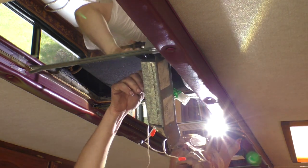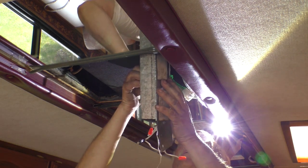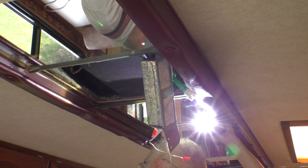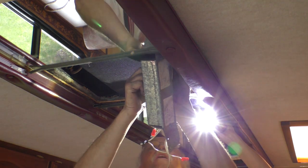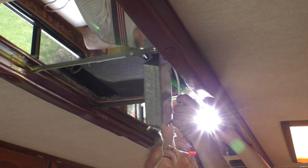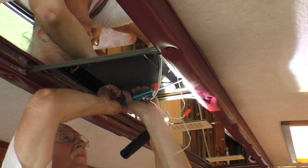So these are the 4 thermostat wires. And Yellow. Oh, I see. Y goes to yellow. That's pretty straightforward. B goes to blue. B probably goes to blue. So gray goes to next to yellow. GL. So yeah, and green goes to GH. So GH is green. Right. Gray goes to GL. I don't know how they get gray out of GL. I think L and H are high and low. Okay.